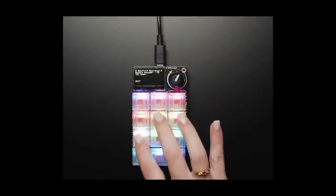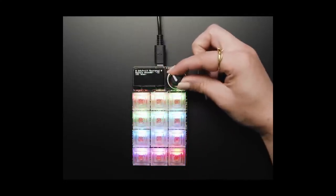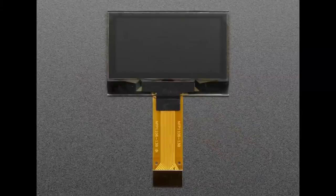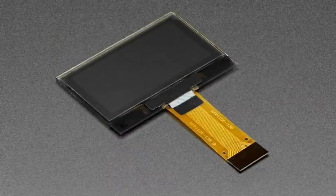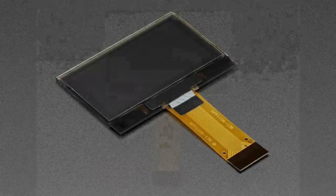If you like the macro pad and you think that's a nice OLED, I really like that the OLED has a little plug-in thing. You don't have to solder it. We have just the OLED available. So can people crack their OLED screens? Maybe they want a replacement. This OLED is an SH1106G 128 by 64 monochrome pixel OLED display.